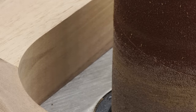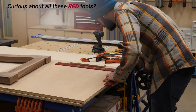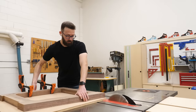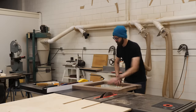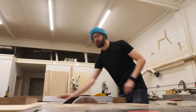Next we're going to grab our plywood sled again and establish a new cut edge — this thing is now a 32nd of an inch closer to its eventual death. We're basically making a giant crosscut sled that we can use to lop off the parts of our leg verticals that extend up past the top of the horizontal pieces. After making this cut on all three legs, technically we could flip them over and do the same thing on the parts that extend past the bottom — but we're not. Instead, what we're going to do is set our table saw's fence to whatever the maximum height of our table is supposed to be, minus the thickness of our top. The next thing we did was start working on the joinery for how the legs and the top are going to attach, but I'm going to come back and talk about all the joinery at the same time a little bit later.